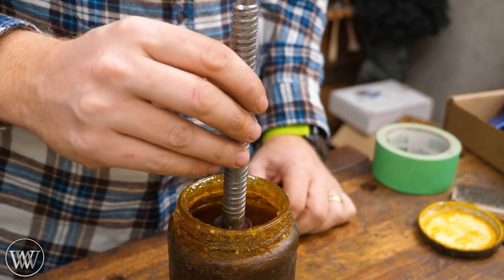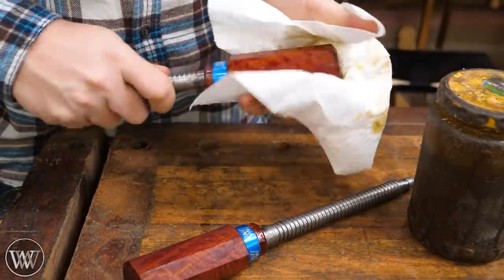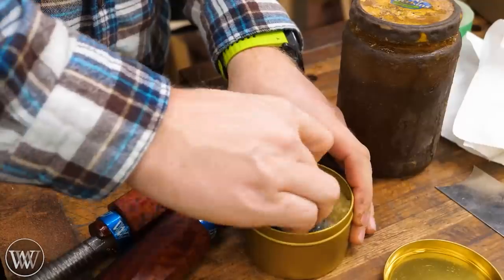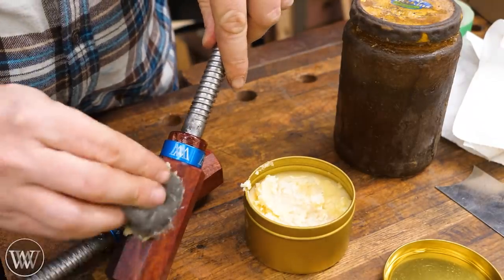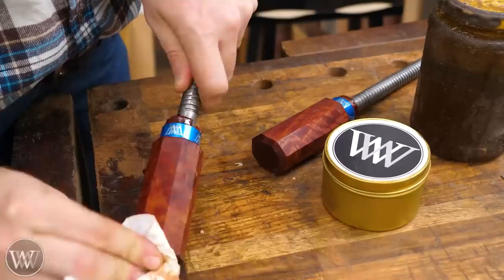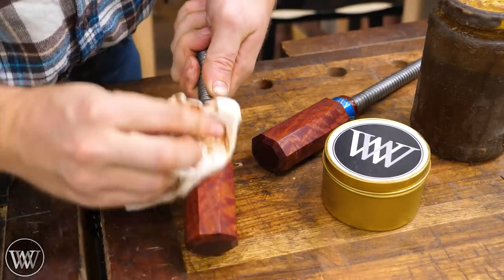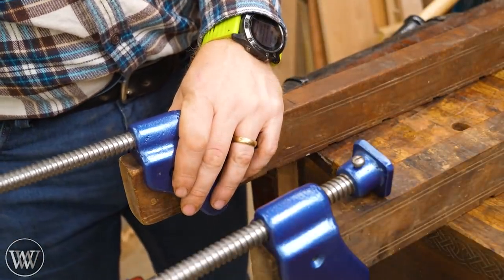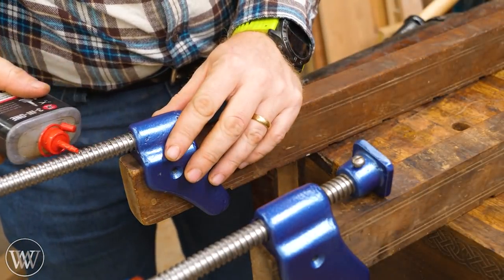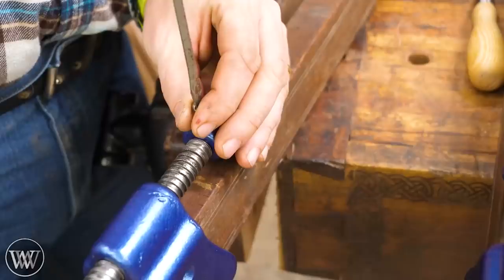This is one of my favorite woods now. The grain structure and color that come out are just beautiful — yes, it really is that red in person. It is a gorgeous wood. It will turn more brown over time, but right now it's really beautiful. I'm using my paste wax to finish — put it on, let it sit until it hardens up, about an hour, then polish it off and you get that gorgeous finish. These are the clamp handles for a new pair of clamps I was recently given; we did some cleanup and restoration on the clamps and can now put them all back together and give them a test drive.